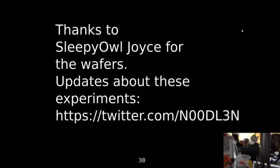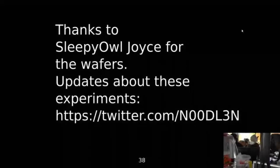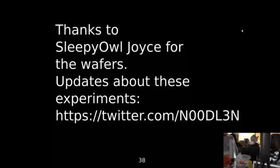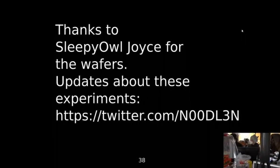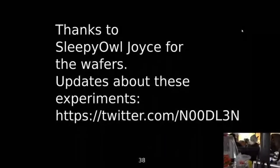Next question is, what does the wafer cost in real life and how much is an electron beamer? Our electron beam device is a very old scanning electron microscope. Those are around 500 to 1,500 euros on eBay. On eBay? Really? Yeah. They're used ones, pretty old ones. And you only have to attach a signal generator, like a Red Pitaya or something like that, and you have a crappy EBL rig. So how much power does it suck? Including the pumps, it's 2 kilowatts, 1 kilowatt. I haven't measured, so I'm not sure. But nothing special needed, so you can more or less plug it in.